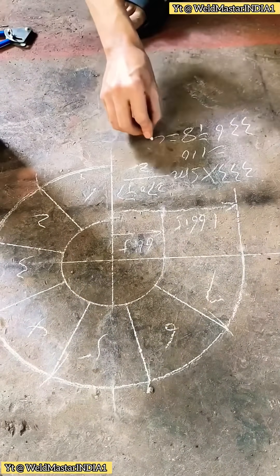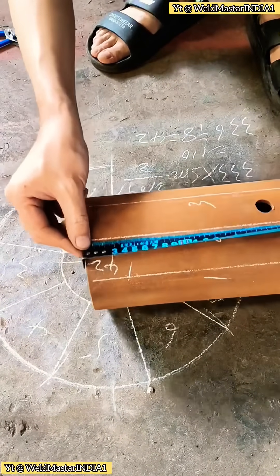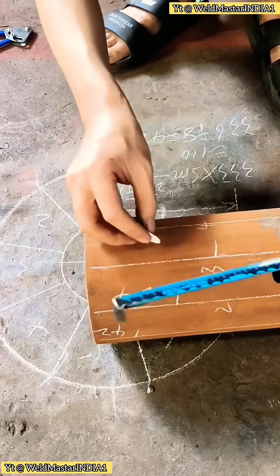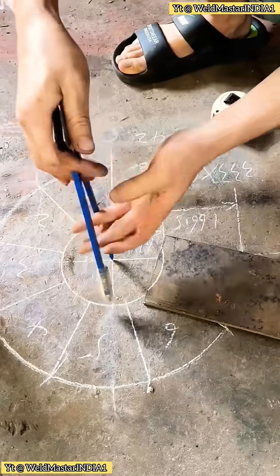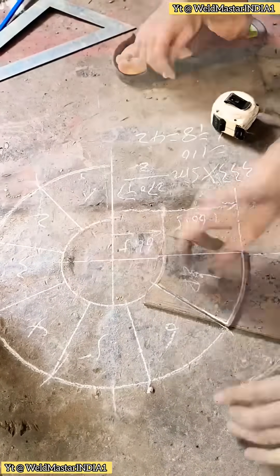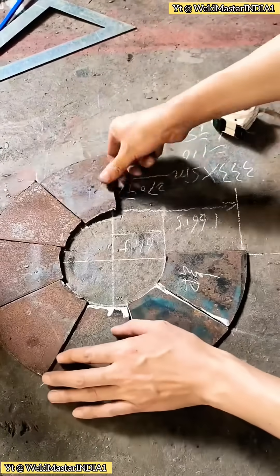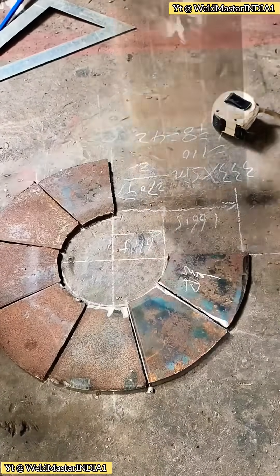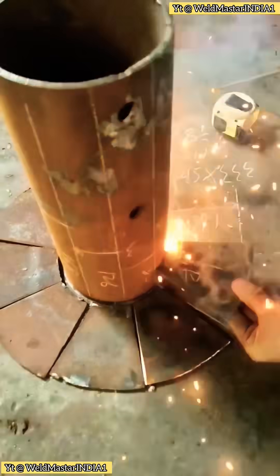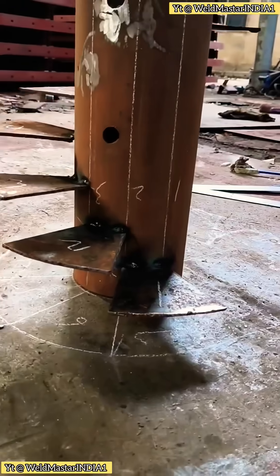The total height of the staircase is 336 millimeters. 336 divided by 8 equals 42 mm, which is the height of each step. Mark every 42 millimeters along the pipe to indicate the step heights. Draw out all seven tread plates — these will later be welded into position. After welding all treads in place, you'll get the basic spiral shape.